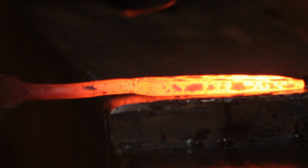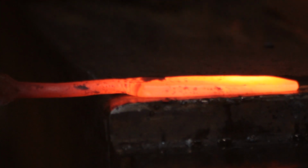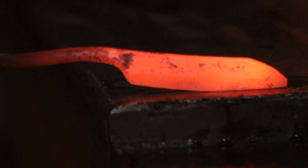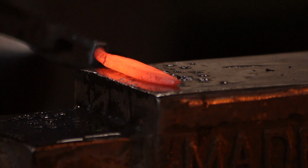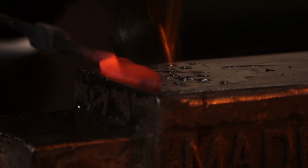I'm using a wet anvil technique for this. And just start with beveling. The wet anvil technique will help blast the scale off. I am vigorously scrubbing with the wire brush between heats. And the water will blast off any scale that forms between the brushing and the forging.